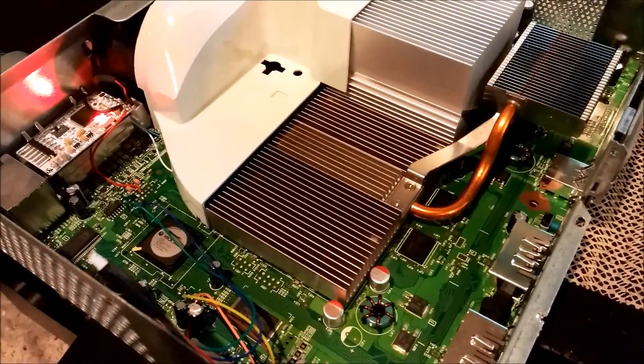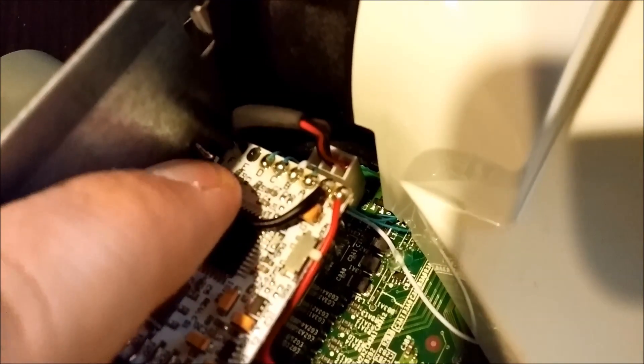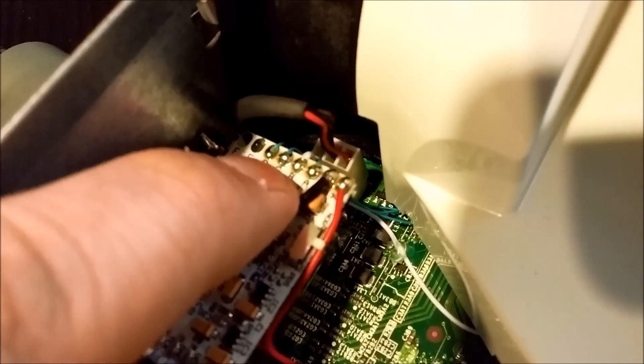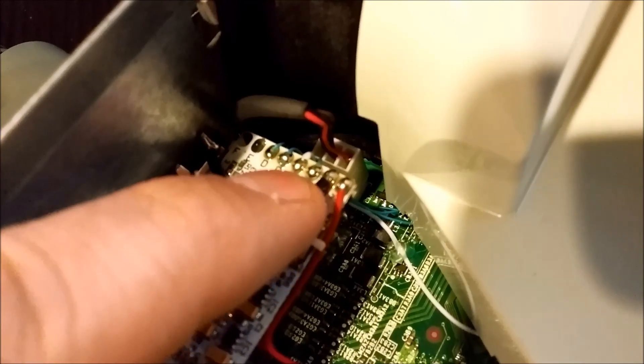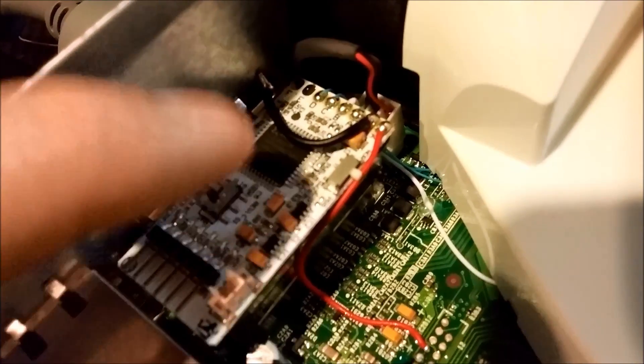Weekend Monitor here with a quick look at the top side and boot sequence of a console wired up with what is being called RGH 1.2. What you can see here is that this console has wired up to it — there's no E and F point, but we have D, CPU RST, C, post out, B for standby click, A for PLL bypass, and then power and ground.